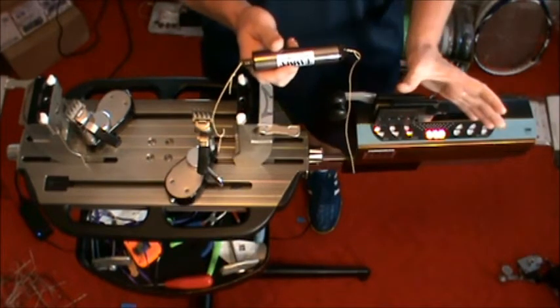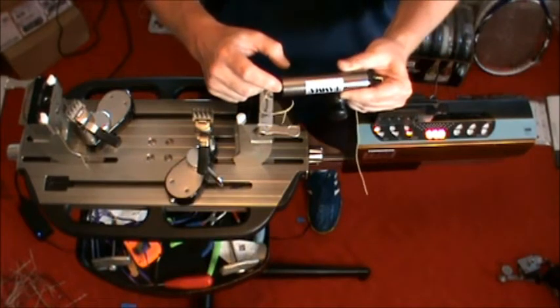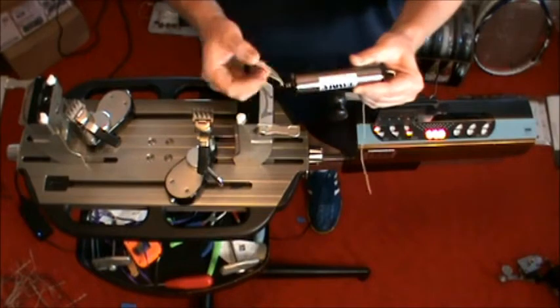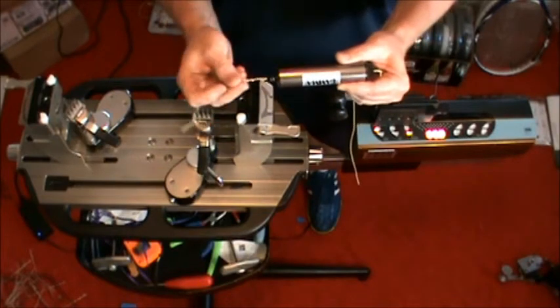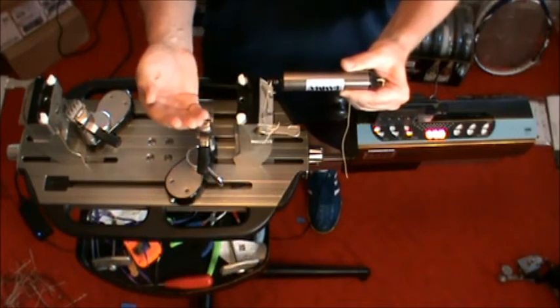In other words, when your brake releases and it locks the mechanism on the track, that's when you want to be staring at this, because that's the only moment that matters on a lockout machine. You don't have to be in a rush to see this with an electronic constant pull or a drop weight, because you want to see that line there constantly.